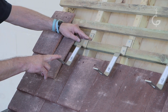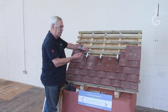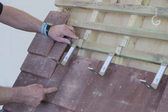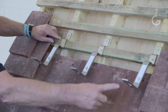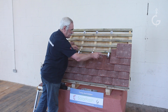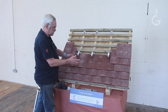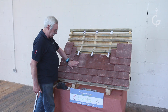The positions of the bracket and the rafter are the same as with slates. There can only be three different positions in relation to this course of tiles or slates. Position A is between those two slates. Position B is in the middle of this slate. And position C is between those two points. If a rafter were to be put anywhere else, it would be in one of those positions in relation to another tile, so you will always have the same group of cuts. You need this clearance and this angle to get away from the thickness of this tile.